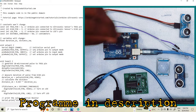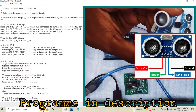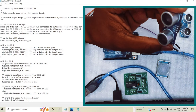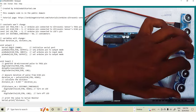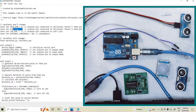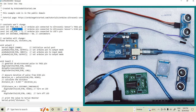The ultrasonic sensor used has four pins: ground, VCC, trigger pin, and echo pin. The VCC and ground are connected to the corresponding pins in Arduino, and the trigger and echo pins are assigned to your Arduino pins. Here I am selecting my trigger pin as pin number 6 and echo pin as pin number 7. Also the pin number of the LED is 3. The LED has two pins, positive and negative — positive is connected to pin 3 and negative is connected to ground.